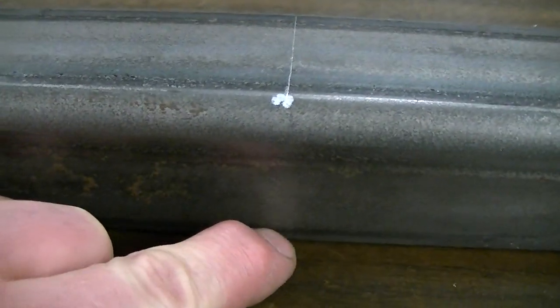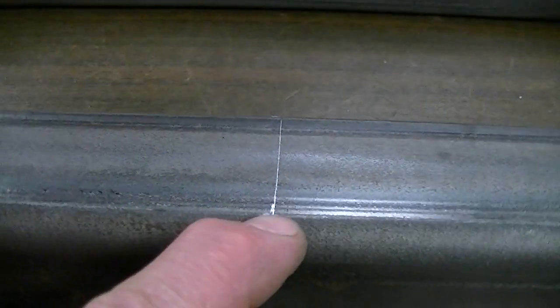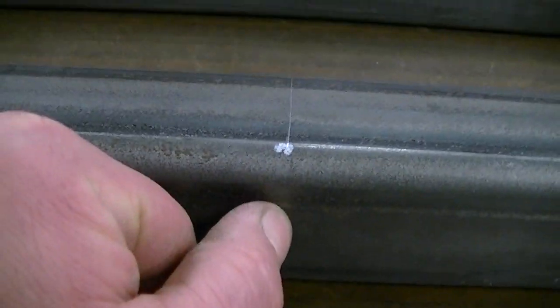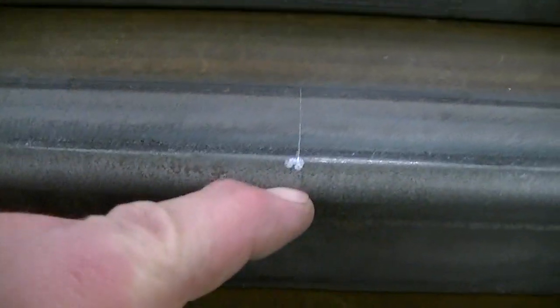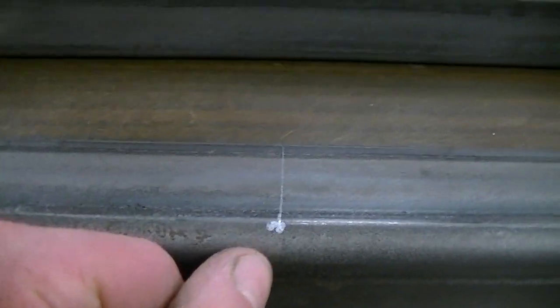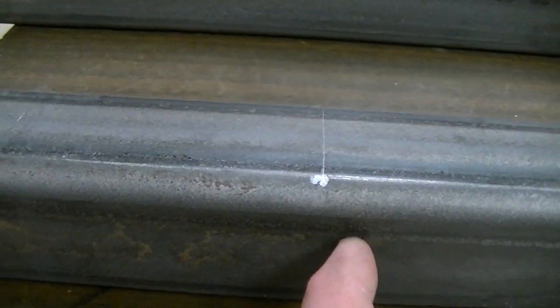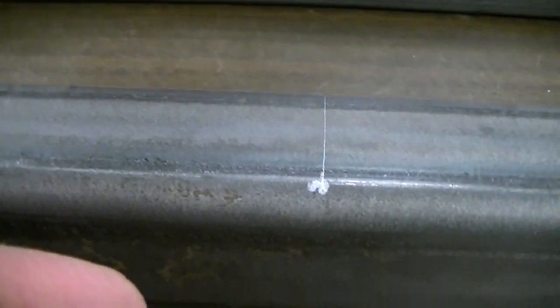In each one of these cut lines I have laid out, I'm going to make a witness mark down the bottom. I have scribe lines on here now, but I'll put a couple of punch marks in so I can follow them a little bit easier. With a witness line perpendicular to the original layout line, I'll be able to keep the tubing pretty square — otherwise you have nothing to reference off of. With that bandsaw, it's pretty easy if you're not careful to have it cutting on an angle, then you end up with one piece too short and the other too long. So I'll probably do that tomorrow.